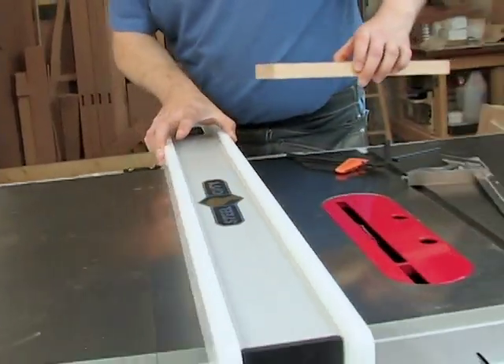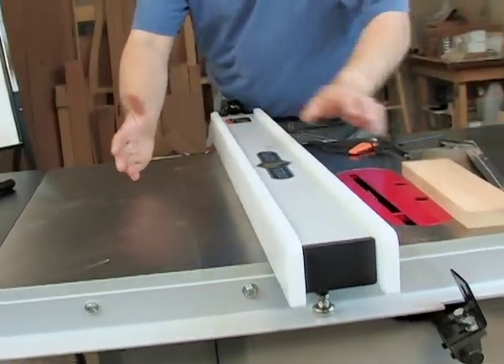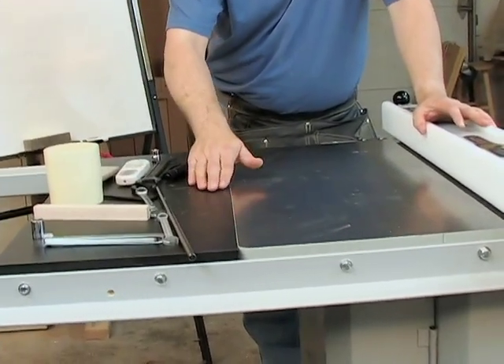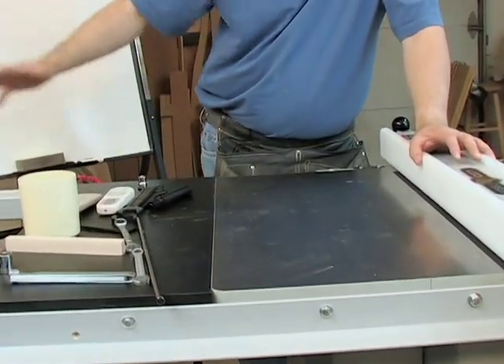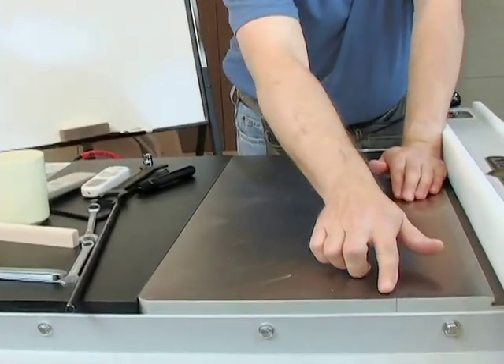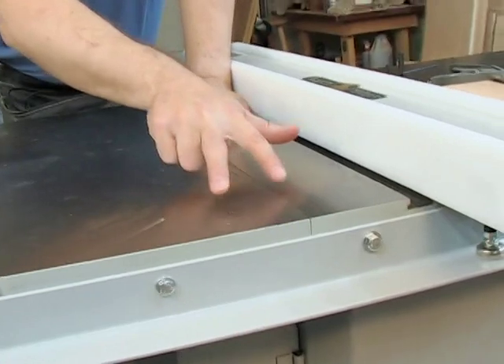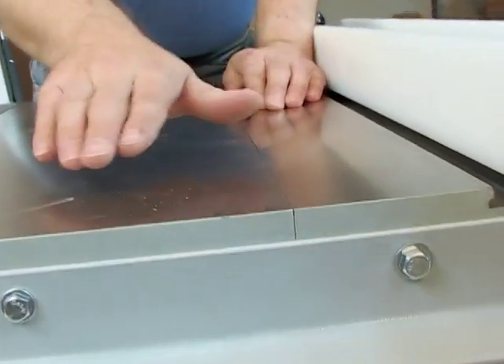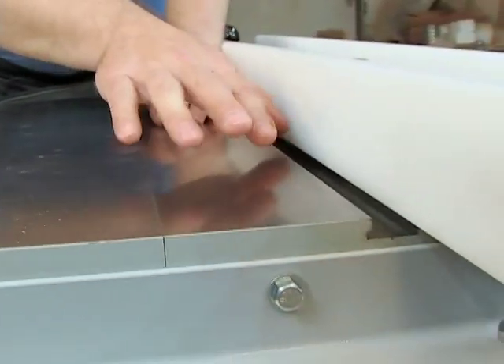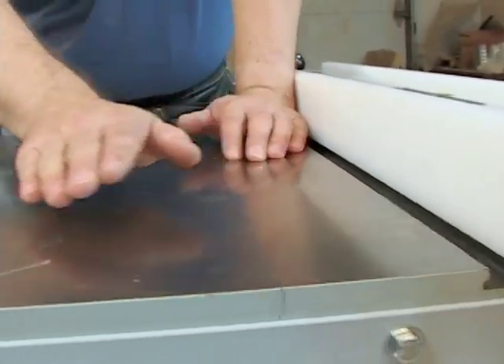On my saw I had to shim underneath with a couple of wooden wedges. It's very important to put the shim material as close to the bolt as you can, because if you put the shim halfway between the bolts and tighten them really tight you're actually bending the casting — and cast iron is brittle and isn't very hard to break. The shim allows me to lift the front edge of the wing upward so it doesn't sag down on the tip.